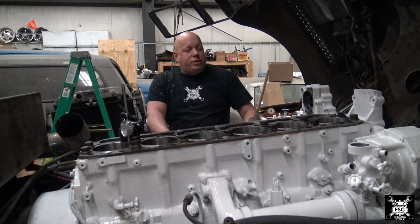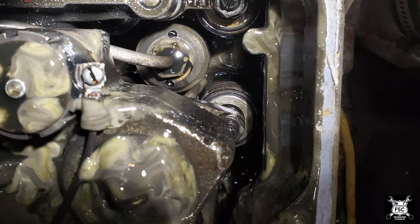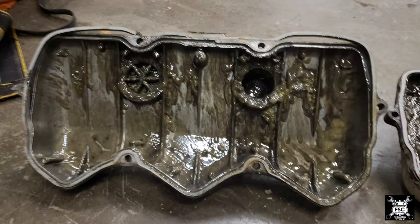It was very obvious. It had that milky color all up in the top of the valve covers, and it was just pretty nasty. But as far as I was told by other friends that I trust, which made sense to me, if you don't lose oil pressure, you have enough lubricity in the oil to survive. Not long, but it beats towing the truck home.